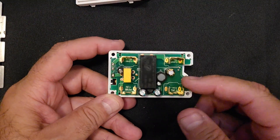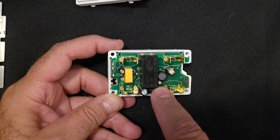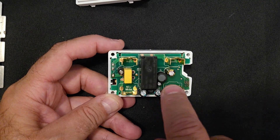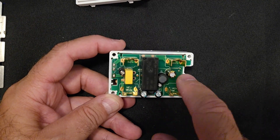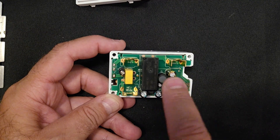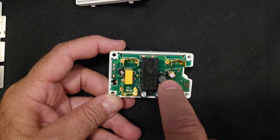I replaced the C7 capacitor. That capacitor is an electrolytic capacitor, so it's important that you make sure the minus and plus are in the right place. There's a little circle on the PC board with a little bold dash on it — that's the minus side. In this case, the minus of this electrolytic points upward towards the coil.